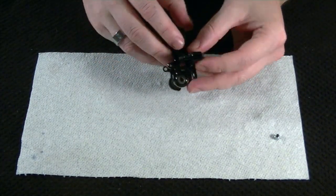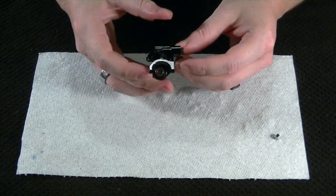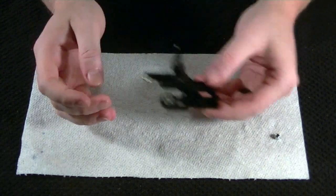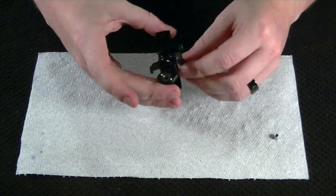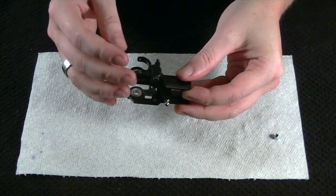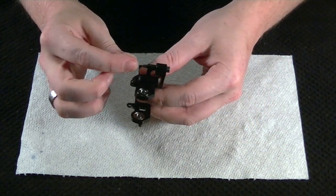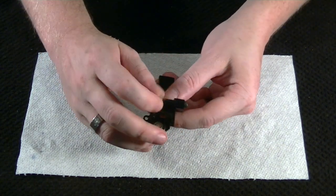So what I did was I applied Loctite on, because like I said, this part here is going to be threaded. But I noticed, if you really wrench it down, you're going to start to lose smoothness on the radial bearings in there. So get it snug down to the point to where it bites. Give it a quick twist. And basically, you want to make sure that it's completely free of any obstructions. No notching, no binding, no anything. Then, once you have that done, you do not have to reapply the Loctite, because you have the lock nut on top with the nylon insert there.